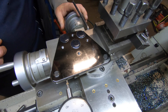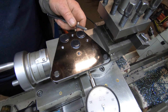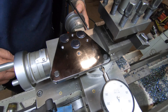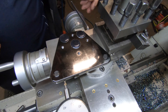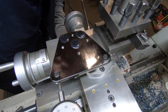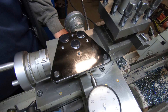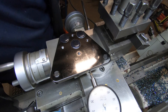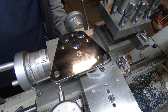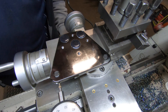There's no way I could have tapped that in right straight off the bat. Let's go from pin to pin. Spot on, pin to pin. Well I'm going to leave it right alone at that and cut it. As you've seen in other videos, I use a sleeve that goes in the headstock — it's a Morse 5 to a Morse 3 — that's what I always use as a master. We'll give that a go and see how close it is. As you can see, that was simple as buggery to set up and it's way better than stuffing around with dial indicators.